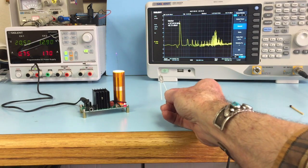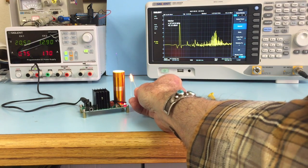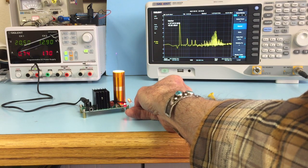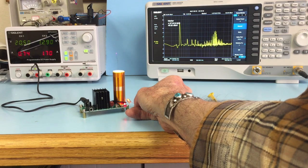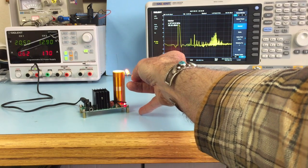They do supply you with a small neon light bulb. You can see it's starting to light up here, and the closer I hold it the brighter it gets. One thing I noticed was at the lower end of the coil it's not as bright, and that's because the secondary voltage is lower at this point. As you go up higher and higher it gets brighter and brighter.